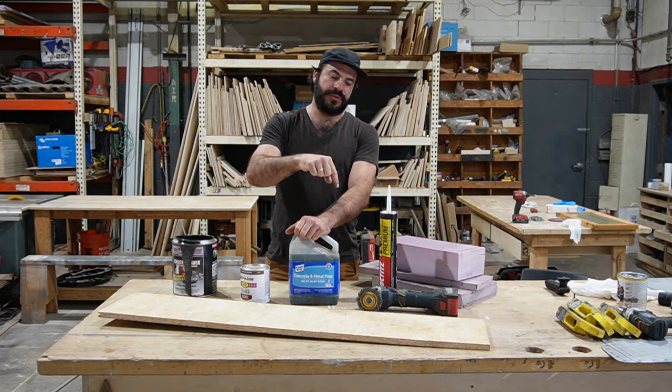I seen other folks doing this subfloor thing recently on YouTube, and you gotta use the tongue and groove style plywood and minimize your number of seams. Oh my gosh, you want it flat. Gotta keep it flat. All right, let's make these cuts.